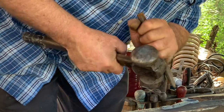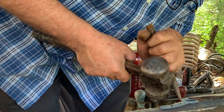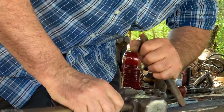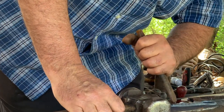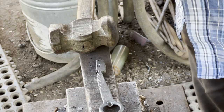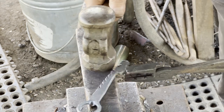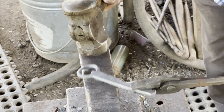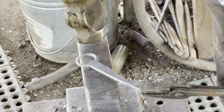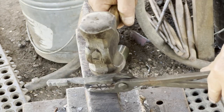This is a fuller, a narrow fuller, probably 3/16 wide. And because this is a longer handle, I'm going to give it 5 marks instead of 3. If it was shorter, from here to the opener, I try and cover that in 3 fuller lines, just fewer hits.